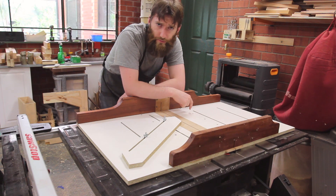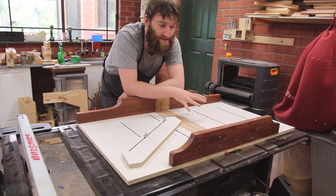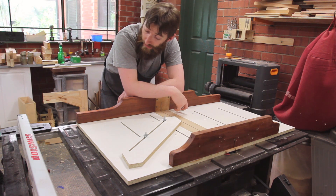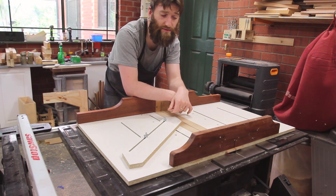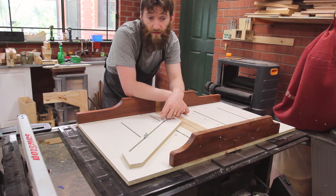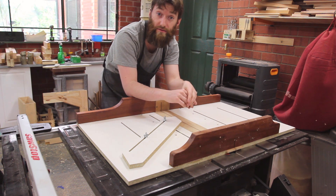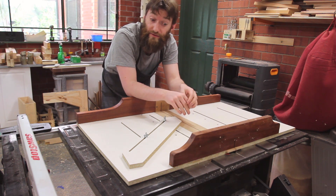My original sled was cheap and quick to make — took about an afternoon and was made entirely out of very low grade plywood. This sled took a lot longer to make but I'm glad I put the extra effort in. The extra features will really come in handy and I've already used the miter fence a few times. While it is a lot heavier, it hasn't really stopped me from using it — it's a little more awkward to put on and take off the table saw, but the melamine is very slick so it slides nicely. Check below for Joe's plans for his version of this sled and links to Eagle Lab Woodworking's Super Sled video series. Thanks for watching.